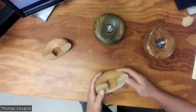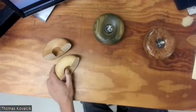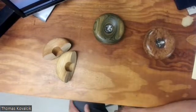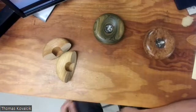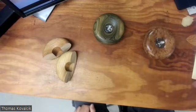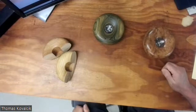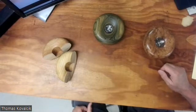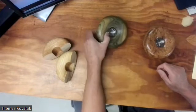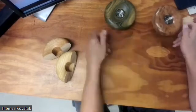The reason for that is basically the wood. When I make these things, I use blanks that are all pre-cut and dried. I make them 5 1/4 diameter by 2.5 inches thick. The reason for 2.5 inches is how I mount them. I don't use a chuck, I use waste blocks, because I have much better access to the bottom, and I don't have to mess around with making the chucks and all that kind of stuff. So it gives me plenty of room to turn these things down.